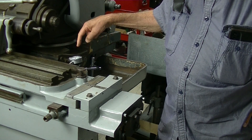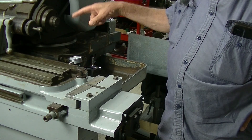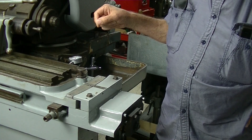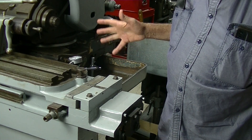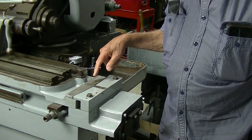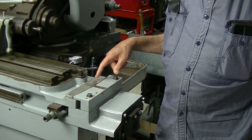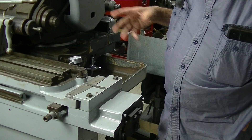What I've done is used the one-hundredth of a millimeter indicator up against the side of the table. I figured I wanted about one and a half millimeters there, so I went three hundredths here, which will bring me up short - but I don't mind being close. I don't have to be exactly at zero if I'm within a hundredth of a millimeter. The scale is marked out in degrees or inches per foot, but there's no really good vernier scale - you won't get better than about half a degree - so you've got to use a dial indicator and calculate the taper.